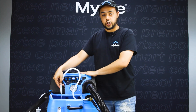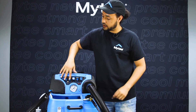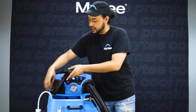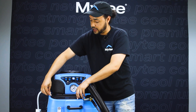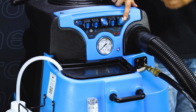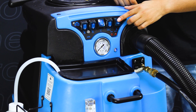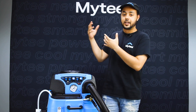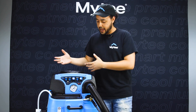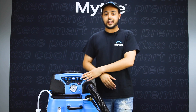If I have a cold unit I can go ahead and hit the vacuum switches and get cleaning now — these two are the vacuum switches. This is a heated unit, so first I want to get my heater preheated. The three-position rocker on the left side is my heater switch. I have both an option for 600 watts of heat if I don't have a 20-amp circuit available — I can run this second cord off a 15-amp circuit instead using the low heat option.